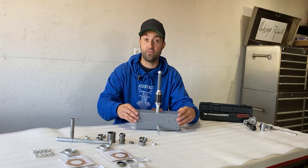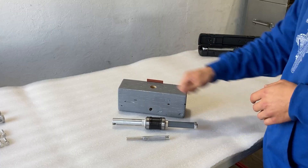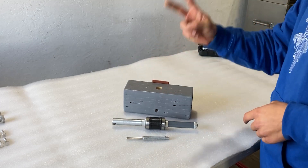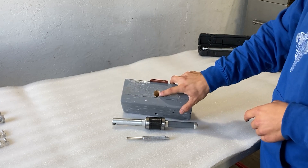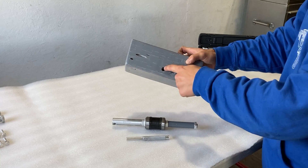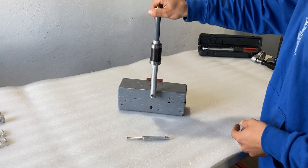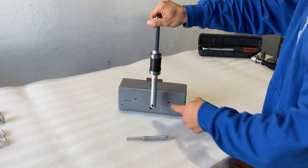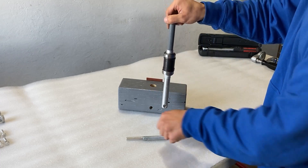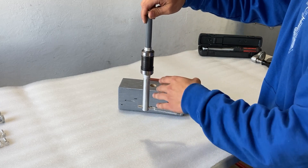The next thing I want to share is this custom fixture for the rear axle shaft assembly. The fixture is made of wood and is exactly 4 inches by 4 inches by 10 inches long. There are exactly two bores within this block: the top one is 22.5 millimeters in diameter, and the bottom one — 90 degrees to the first bore — is 9 millimeters in diameter. The first bore accommodates the larger end of the axle shaft. Not only does this keep the axle shaft perfectly vertical for assembly, but in the 9 millimeter hole I can insert a punch to stop the shaft from rotating.